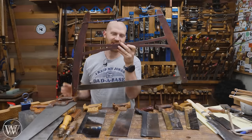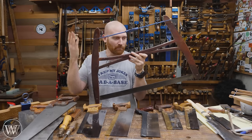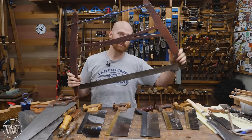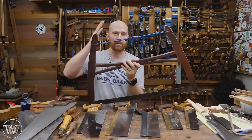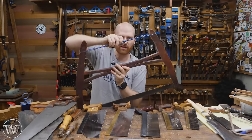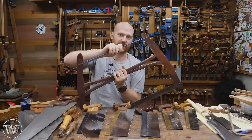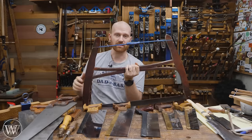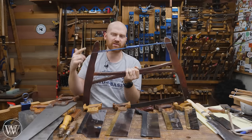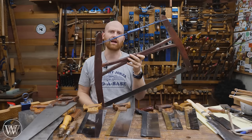Next is the buck saw, used for bucking logs — cutting logs down into smaller pieces, slicing into about 18-inch slices before cutting them into firewood. It is a type of bow saw and therefore a type of frame saw. This one has a turnbuckle on top — rather than a rope, it's a solid piece of wire pulled tight. A note about all frame saws: when you're done cutting for the day, take the tension off. Leaving them under tension will slowly wear them out over time.